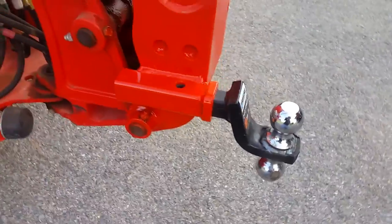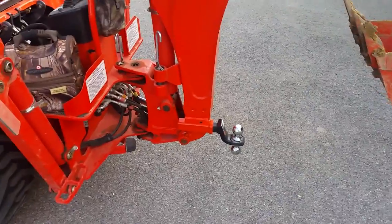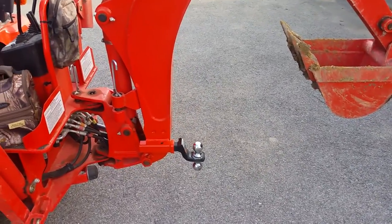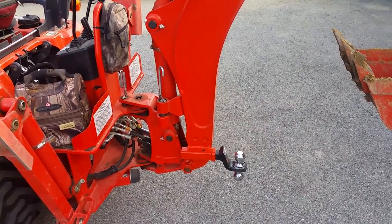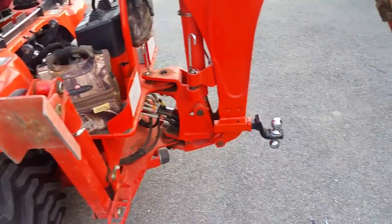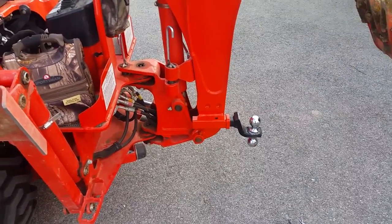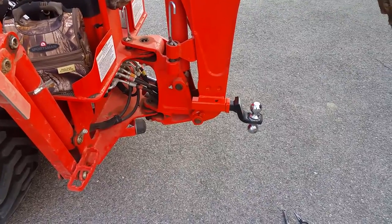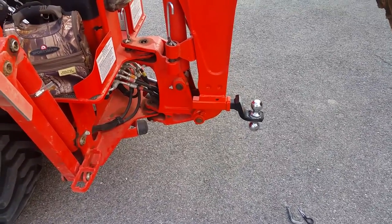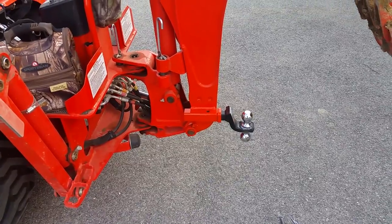It really works great — I never have to remove my backhoe. I have another trailer, a little five-by-six footer, and it works great with that too. I always put a longer tongue on trailers when I buy them because I like to see the trailer behind me — it makes me feel more secure. If you're like me and don't like taking your backhoe off all the time just to pull a trailer, there's a remedy for it. You could also go with a two-inch receiver if you want — that's anyone's choice — just make sure before you weld it on that everything will work. But I guarantee the one-and-a-quarter works like a champ. Thanks for watching.